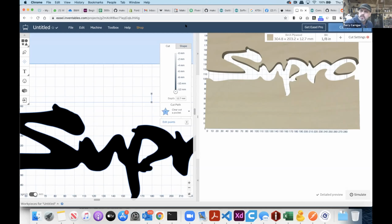What is that process called? It's just a post-processor, and it'll be in your tool path setup. You'll be able to actually generate separate tool paths, so it'll be under tool paths and tool change. Okay, in Fusion 360. I'll look for that. And then there's also a Maslow post-processor for Fusion 360, so that it'll tweak some of the settings to make it more Maslow and M2 compatible. In Maslow or in Fusion? That's in Fusion. It's a plugin that you can install. Okay, great.